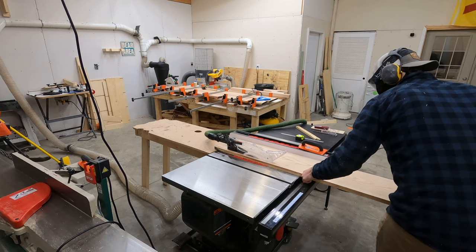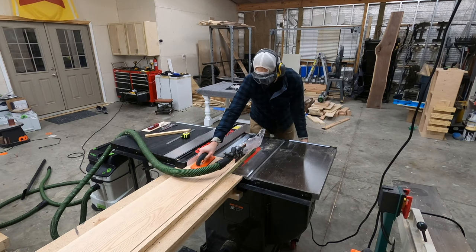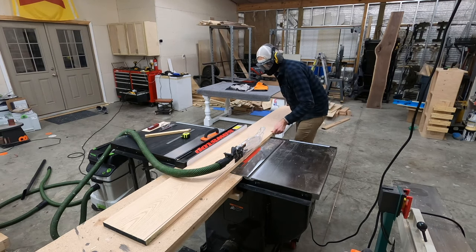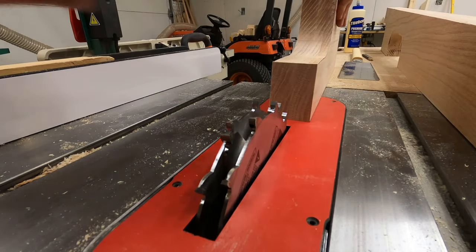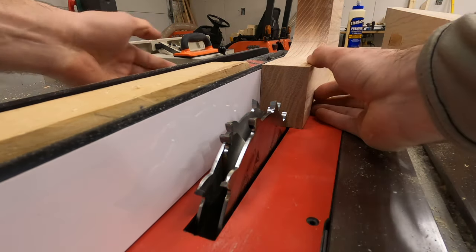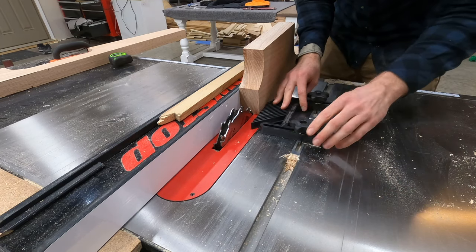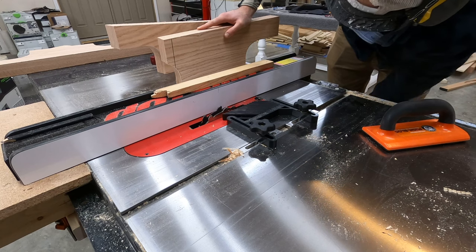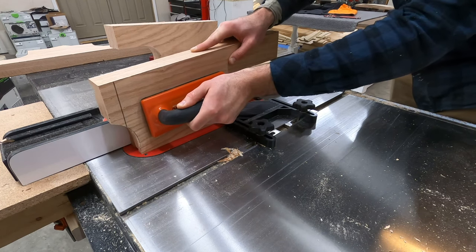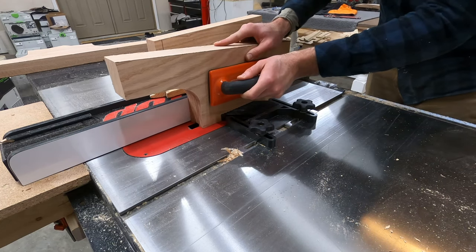While the glue on the headboard set up to dry, I grabbed all the other pieces to cut out the rails and footboard. I'm ripping all the oak pieces to 10 inches wide, which is the width of each rail and the footboard. This is the point of the build where things get a little complicated — we need to attach the foot and headboard panels to the leg pieces we cut earlier. The problem is we essentially have a giant butt joint where the grain runs in opposite directions, which makes it difficult to connect because any domino, tenon, dowel, or fastener will restrict wood movement and could cause the interior panel to crack over time.